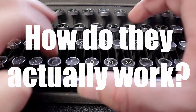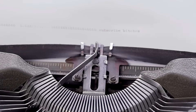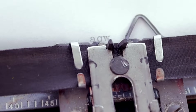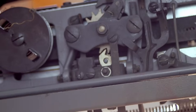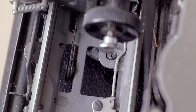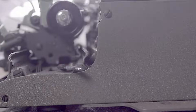How do they actually work? As you press down on a key, the corresponding arm is flung onto the paper via some mechanism. In this case, it's these gears. Another mechanism is used in parallel to push the ribbon up just as the key is about to hit the paper. The ribbon is where the actual ink is, not the key itself. One really has to reach the end of the keystroke to properly hit the escapement bar. This is what lets the carriage move forward one step at a time. I told you, this thing was pretty sick.